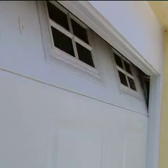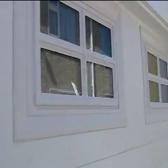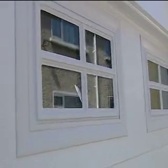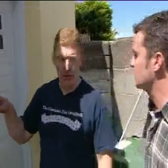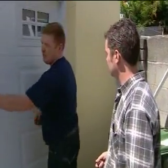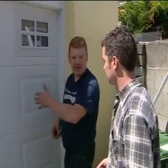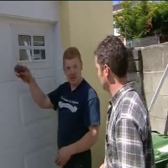But what would the advantages of a sectional door be over, say, the traditional double doors or a bifold door? Well, the most obvious thing probably is the fact that it opens vertically and folds back in on the ceiling, so you have none of this outswing with a traditional tilt-up door or outswing doors. Alright, so it's not going to bump off the car if you're in front of it? No, and it's completely sealed all around, across the bottom and all around the perimeter. And also they're available in a lot more styles, so you can get Georgian raised panels like this one, but they're also available with just a horizontal ribbed effect, or what's popular in our coach house doors that look like barn doors but are actually sectional and open straight up as well. Right.